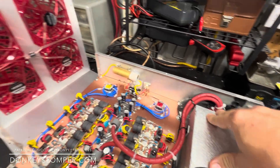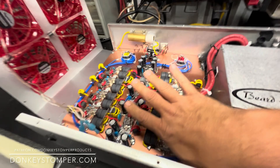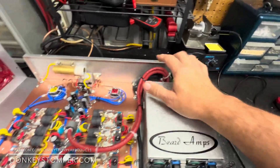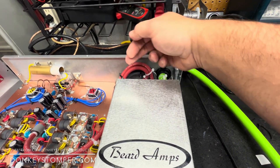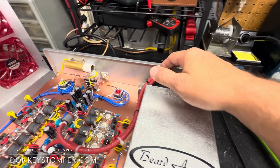One of the problems was the way I had it wired — all the wires were coming right here and blocking this port so air couldn't get in. So I rewired it using copper jumpers, three and three, and put a 4-gauge wire on each one — hot and ground.